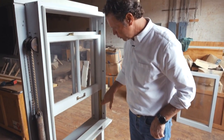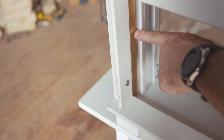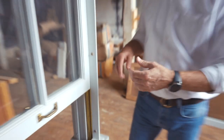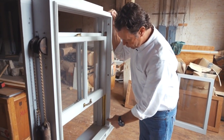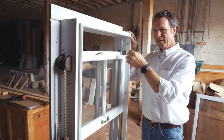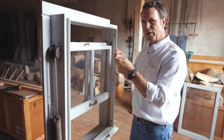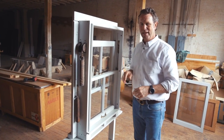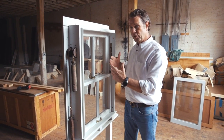We're showing two different types of weather stripping. This is a grooved weather stripping here, and then there's a sprung weather stripping over there. The sprung weather stripping I don't like as much — there's not as much historic precedent for it. This one is a groove that fits inside your sash and really creates a sash that doesn't move very much and it won't rattle. The other great thing is that there is a movable stop — an interior stop with these screws right here. There's a little elongated hole right behind that screw head, so that if there's a rainy season and things start swelling and you can't move your window, you can adjust these, loosen them a little bit, and the sash can move up and down much more easily. This is a way to make your sash completely tight — with this adjustable stop and the weather stripping that allows it to hit that grade 40 standard.